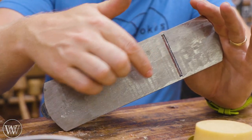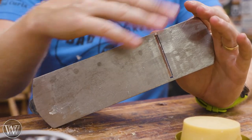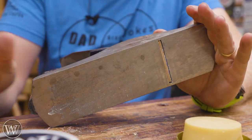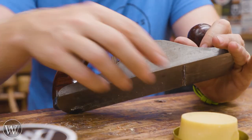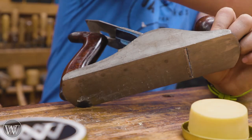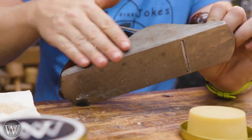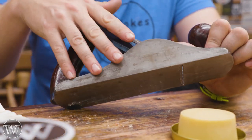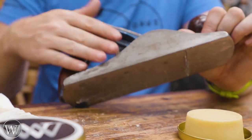People ask: is this wax going to cause problems with finish on wood? Absolutely not. After the first stroke or two the visible wax is gone but you still get the lubrication. It really doesn't affect the finish at all — I've never had any problem with it, even on my smoothing plane with the very last pass before finishing. The other place where I use this quite a bit is for rust prevention. I'll rub it on the surfaces, come in with a rag and polish it down into the steel, putting a layer of wax and oil on there that will protect it from any rust — especially if I'm going to be traveling or if it's going to be in a wood box.